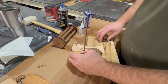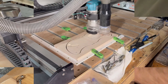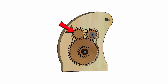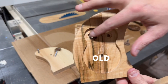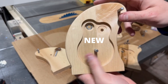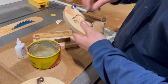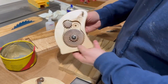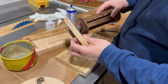Unfortunately at this point when I'm adding on this smaller gear, I realized I made an absolutely ginormous mistake and actually need to remake the side panels completely. Essentially that upper left drive gear shouldn't be interlocked with the larger stacked gear at all — instead it should be moved up a slight bit and driving the smaller gear, which in turn drives the larger gear. This is what the new piece should look like. With that giant issue fixed I repeated the process for attaching the gears, but this time I decided to add paste wax to try to reduce any friction between the gears, and that ended up working pretty well.